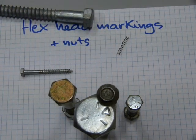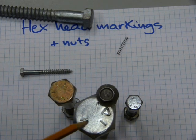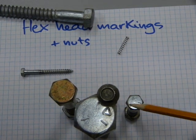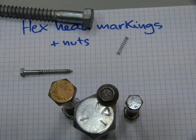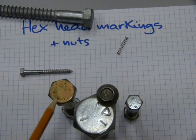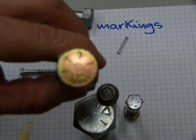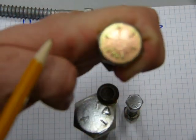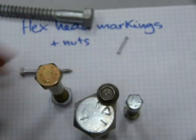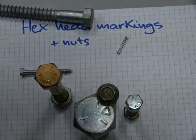What matters here is counting whiskers — these ones. On this one you can see it's got three whiskers on it in a particular arrangement. That one also has three in the same arrangement. This one has six whiskers: one, two, three, four, five, six. Six whiskers on that one. And these correspond to the material of the bolt and its strength.